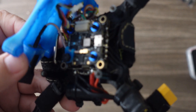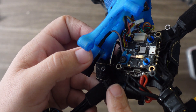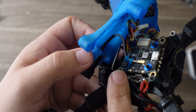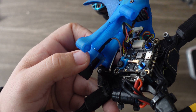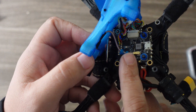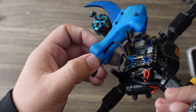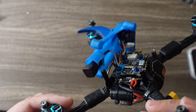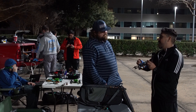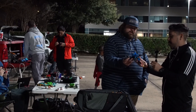Here is the height before — I do have this mounted to the top of the flight controller, which won't need to be there anymore because it's a little tight in there. I did add this little strain relief piece that was posted by one of the guys on the ELRS group — I will link that below. I think a lot of people can use something like this little printed piece for a lot of different builds. It really takes all the strain off if you have a UFL that's close to a standoff like this, so now I can pull it and it's not going to yank the UFL out.